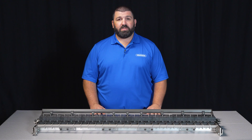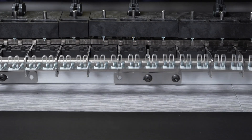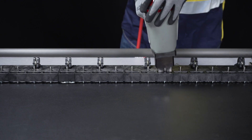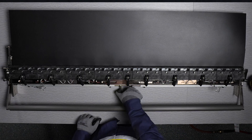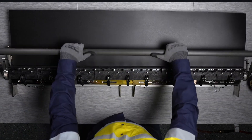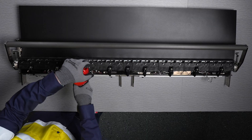There are three simple steps to properly use the Alligator Staple installation tool. First, place the fasteners and belts into the base and drive the staples for the initial set. Next, adjust the tool to its final set position by flipping the handle. Lastly, set the staples for a final set.